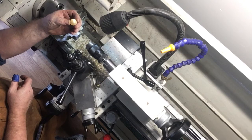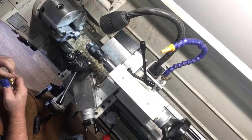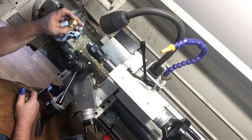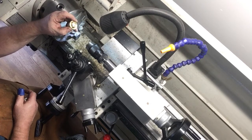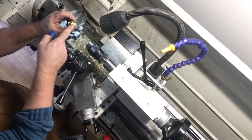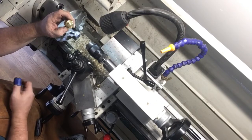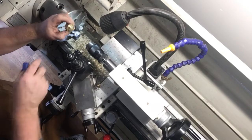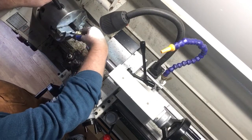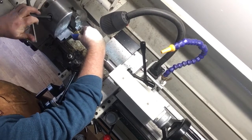This is a pad cup with a slight bevel to the top. The tools I made are all turned out of some brass. Metal spinners call this a chuck — it's basically a turned piece of brass that is the inside diameter of the pad cup that I needed to make, and that goes in my lathe chuck.